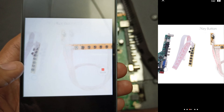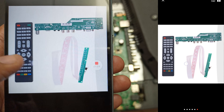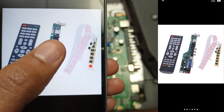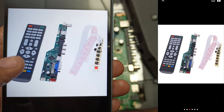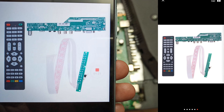I've discovered a very big mistake. When I fixed this onto the chassis, the bulge on the negative side was actually touching the chassis, and that's why I received a mild shock when I touched the metallic surface on the switch. I wanted to use tape to isolate the problem, but just flipping this upside down will fix it. I'll use the original screw — and the problem is fixed. Right now there's no connection between the primary side and the chassis.